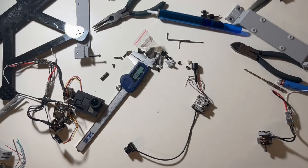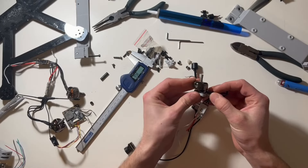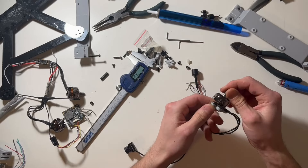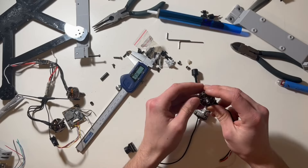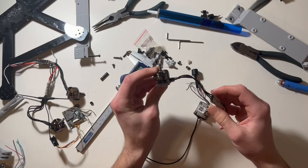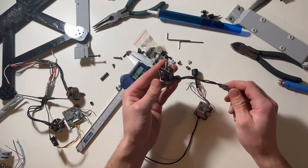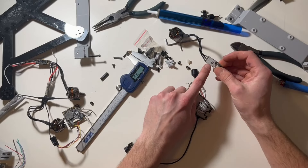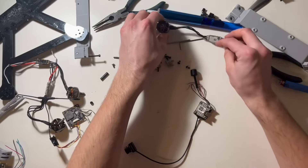Let's do a little rundown of what components we're going to use. Motors: we're going to use some 2207 Emax Eco Line motors. I think these are still pretty good. Specifically the 1900 kV variant — I bought these for a similar project and at the time I was thinking 3-cell batteries with like an 8 or 7-inch prop. For ESCs, I don't know what they are because the label's been ripped off. All I know is that they run Dshot 1200, which isn't supported anymore, but I think that'll be okay.